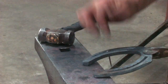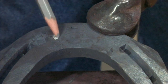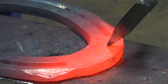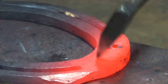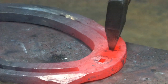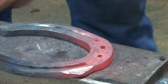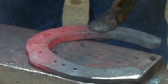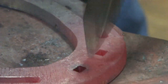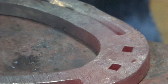Be aware they've got to fit. That's good. Now we've got to put two nail holes in the toe, then we can clip it. I didn't overheat it because I'm putting the nail holes in and I don't want to damage my punch. Just each side of center — about a quarter of an inch each side of the center. I'm punching them upright. Stamp it one more time to make sure they're clean and crisp, then we can pritchell.